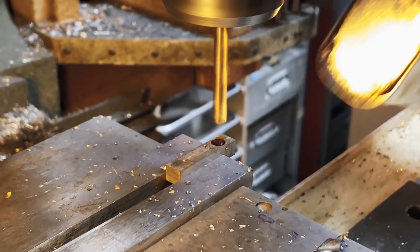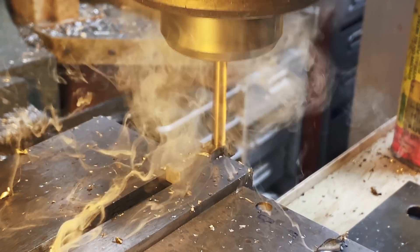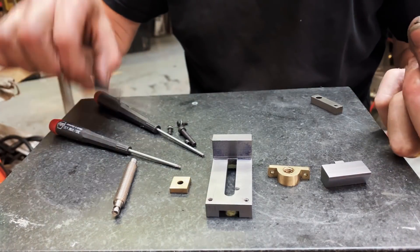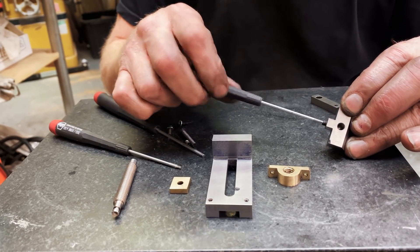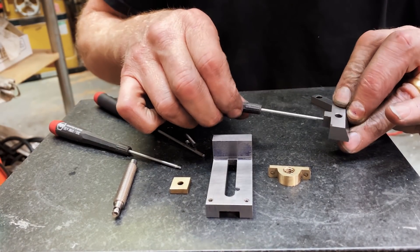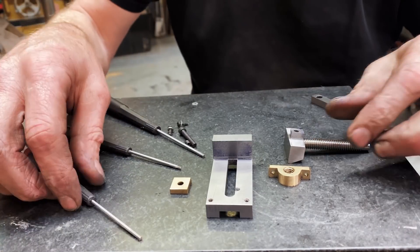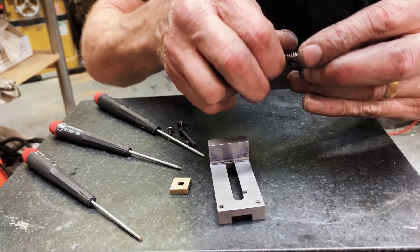This hole that I'm drilling now will receive the threaded rod. I really want this hole to be perfect — this is a tiny little part, so I'm going very carefully, pulling out maybe 30, 40, 50 thou at a time. Now I've got all the parts. This is a little turned-down set screw that goes in, and the nubbin at the end of it holds on to the end of the stainless steel threaded rod. You'll see me stick the stainless steel threaded rod in there and then turn the set screw a couple turns until it grabs — and you can see it spins but doesn't let go.